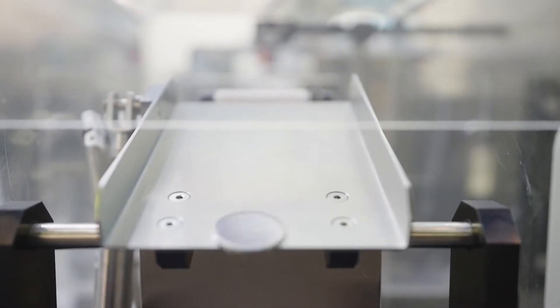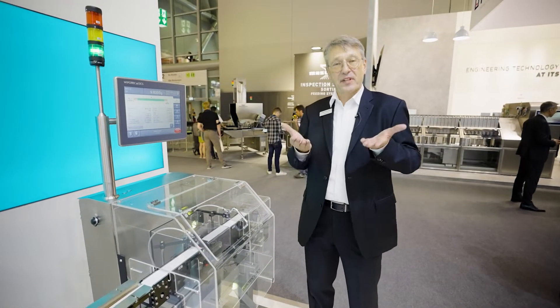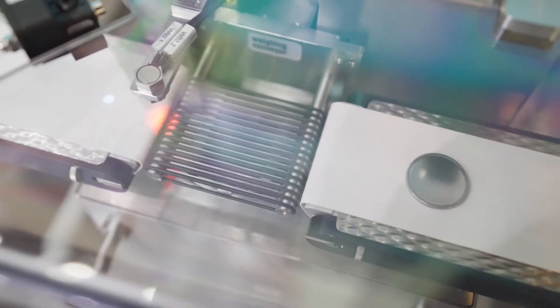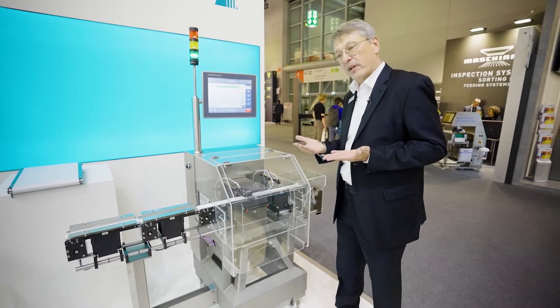This time it was dropping to the floor, but there could also be a box. Particularly interesting, the weighing conveyor is made as a lift-up system. The product is moved onto the weighing conveyor, the weighing conveyor is set down, sitting now on the weigh cell. When the weight reading is ready, it lifts up and the product is transported off.